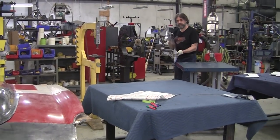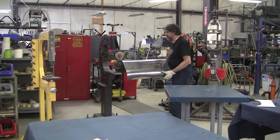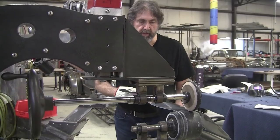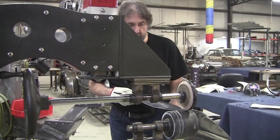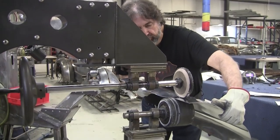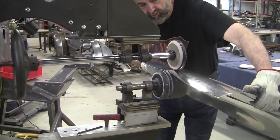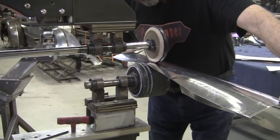We've got the line all marked, and we've got to drive along that line. And we're going to throw this flange out and put this radius in. So we have the maple upper wheel with some duct tape on it, some Gorilla tape, and we're going to use that as the fulcrum. And this is the lever, and we're just going to carefully steer over here right on the line, which came from the flexible shape pattern, and we're going to lift this up.